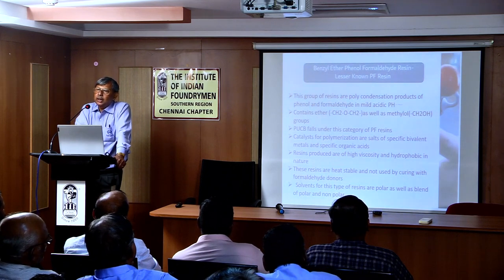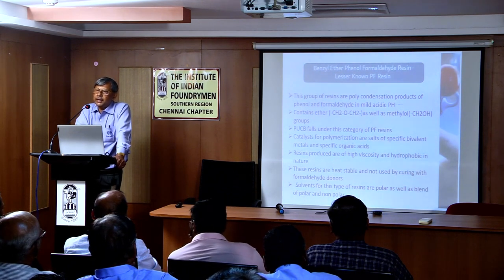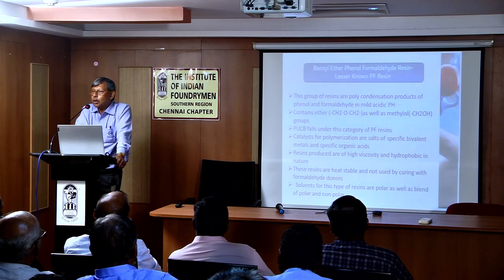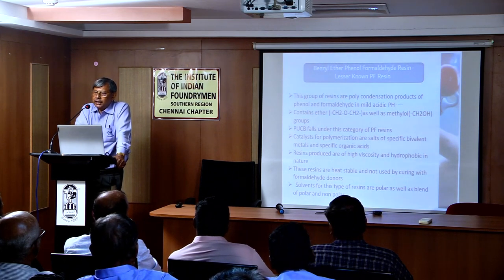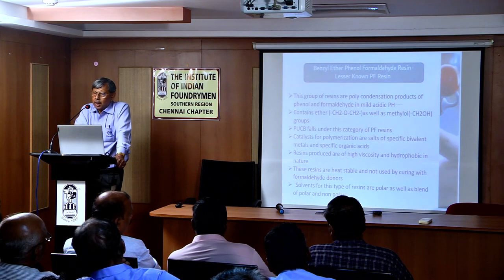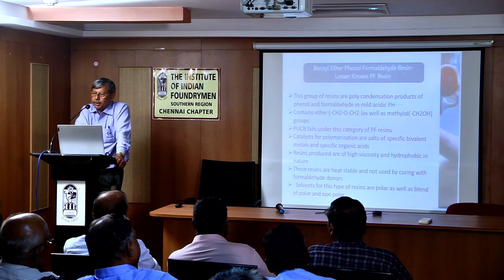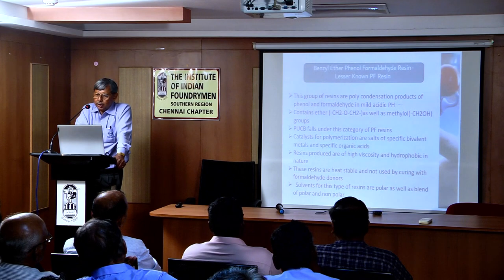The main modification is that at that time the usage of the resin was 1.2% of sand, but now it has come down to 0.75. So a lot of modification has been taking place, and I will go through the ins and outs of the synthesis of the resin. The name of the resin comes from the linkage of phenolic urethane. This urethane linkage takes place in the reaction of phenolic resin and isocyanates.